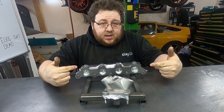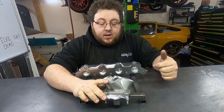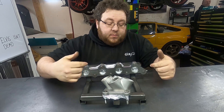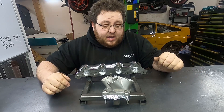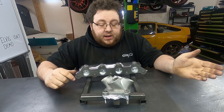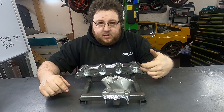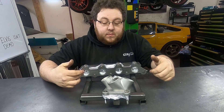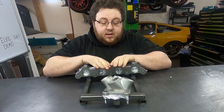So that's the collector and the flange bolted in the jig. We've moved the collector back 3mm to account for the shrinkage that may happen. We've used tin foil in between to form a gasket so when we purge it the gas doesn't escape everywhere. So what we're going to do now is weld all the runners — pretty simple. We're going to go from here to cylinder 4, there to cylinder 1, then cylinder 2 and 3, going up and over into these ports here.